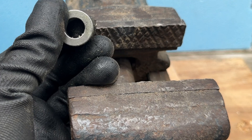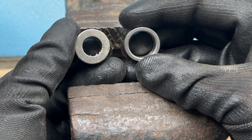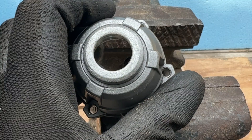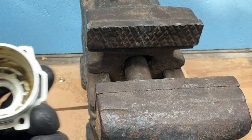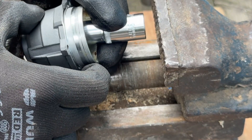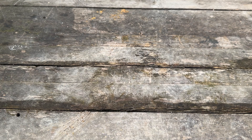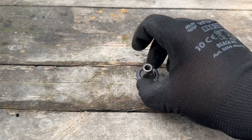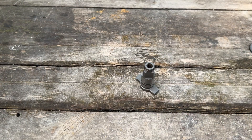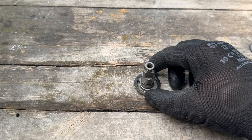You can now see why I like using steel bushings — they're pretty much exactly the same as the original part. After removing the old bushing, it's just a question of reversing the process and fitting in the new one. For this one we'll fit the 18-millimeter anvil. We've got two options: we can go for a full metal washer, or we can still use the big metal washer that came in the original tool.